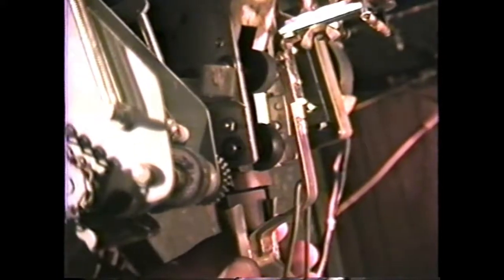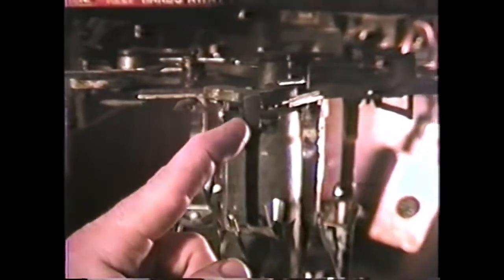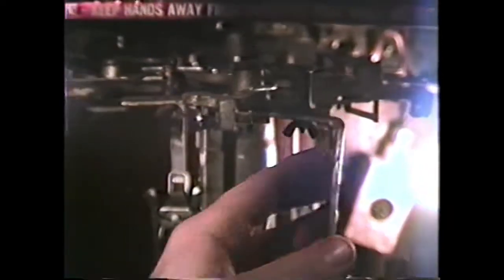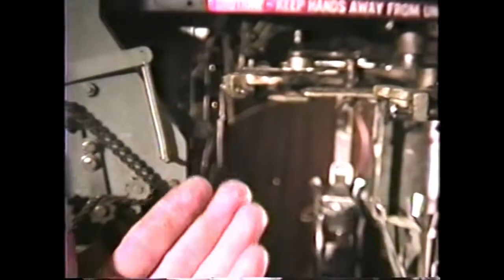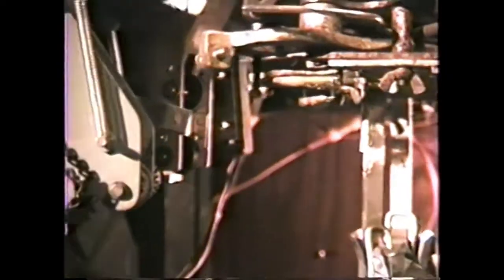Now what you want to do is align your carrier with the feed down so these strips are even — that will give you good feed down. You don't want it over too far this way or that way, otherwise the strip is going to miss the carrier and fall into the tanks. To adjust the carriers, loosen the lock nut on the screw so it is finger-loose. Do this on all of them before you proceed — it makes it a lot easier. Loosen your lock nut, make sure your screw is nice and loose, and that way you can adjust your carrier left and right. Once aligned, back it down just a little bit. Swing your carrier over to the off position and proceed with the next carrier until all seven carriers are aligned. Then remember to tighten your lock nuts. Roll your paper down and pull it all the way out to remove it.